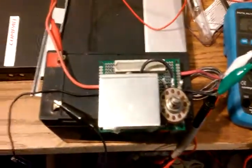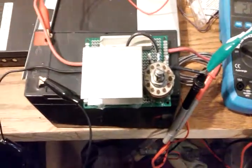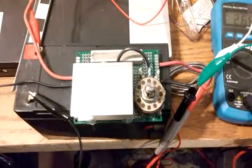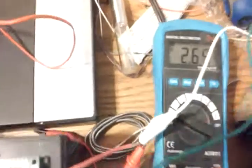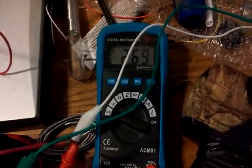I made my LM317 laser diode driver. I need to have it dialed in to 2.69 volts, which is where I'm at — 2.68, 2.69 — right teetering on the edge.